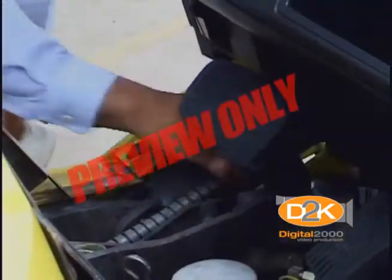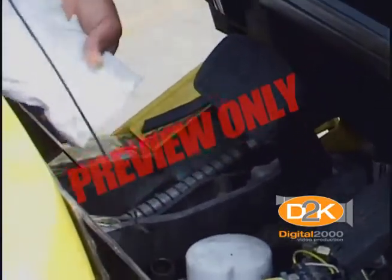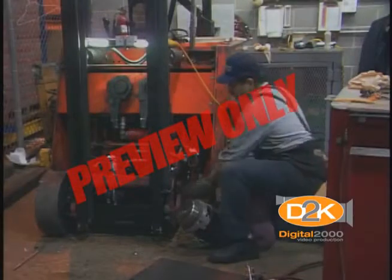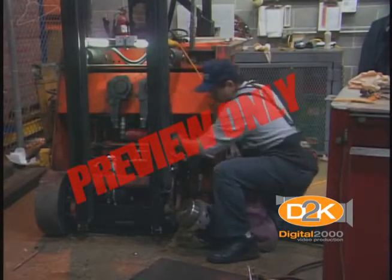If at any time a powered industrial truck is found to be in need of repair, defective, or in any way unsafe, the truck shall be taken out of service until it has been restored to safe operating condition.